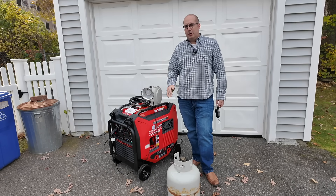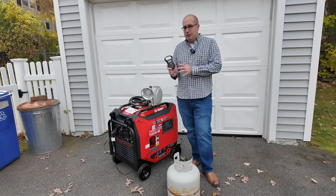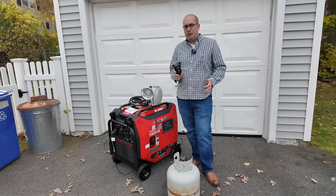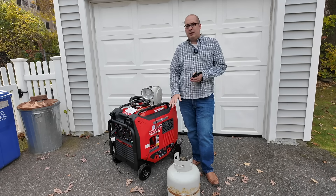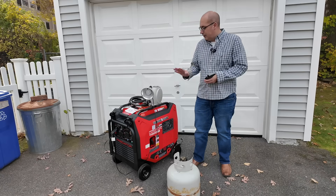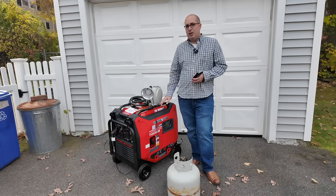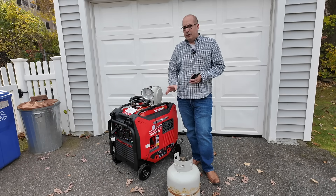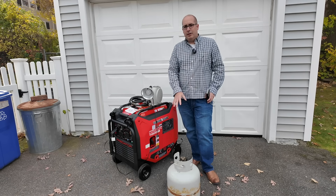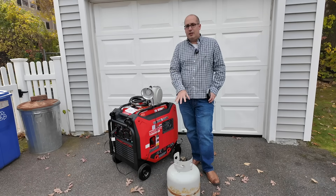As I made a mistake in a previous video with a smaller generator, I never weighed the tank. So I have my trusty propane tank scale here — I'm going to link to this in the description — and we're going to see the exact weight of this tank before we start this test. This tank is independently filled, not one of those exchange tanks like the Blue Rhino or Paraco. I have it filled at my local propane dealer. Harbor Freight says you should use a minimum of a 40-pound propane tank with this generator to prevent the tank from icing up and restricting propane flow. Most folks don't have 40-pound tanks — they have typical barbecue 20-pound tanks or 30-pound tanks. I have a 30-pound tank, but I really want to test this on the 20-pound because I think that's the tank most folks are going to want to use.